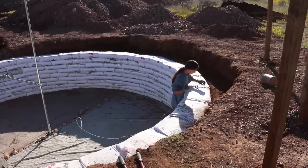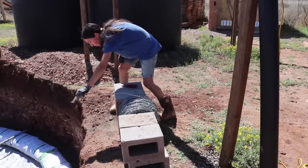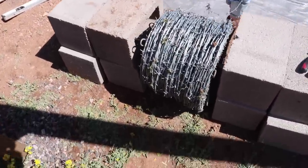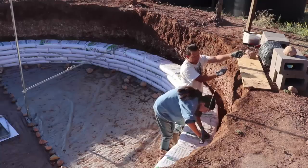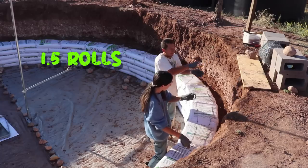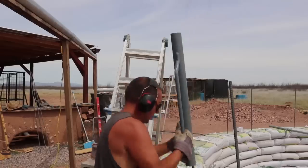For every course of earth bags you want to add barbed wire to help keep everything stabilized. You can find two different thicknesses at your local supply store. For a house or cistern you want the thicker gauge four-prong barbed wire — it acts like a velcro mortar between rows, adding tensile strength. We used about one and a half rolls at $80 each, so $120.